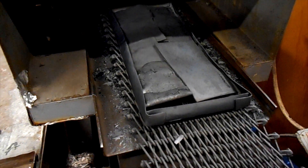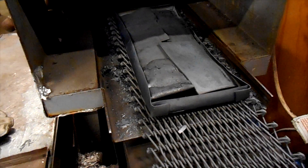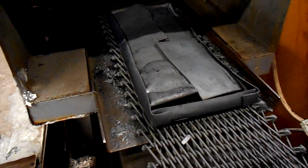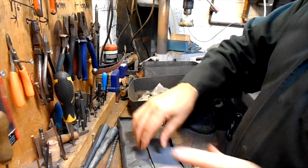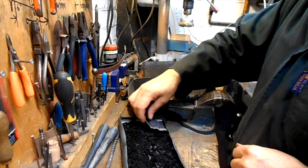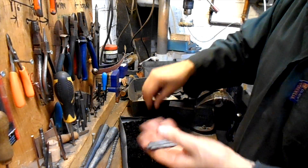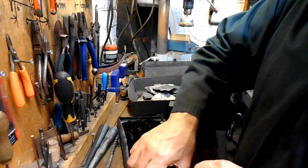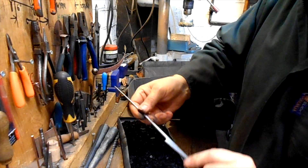There we have the carburised product in the tin, just coming off the furnace. It's taken about an hour and a half to go through the entire process — obviously we're running a continuous belt. We'll take this across for stripping down. This has been through the furnace and been carburised, so we'll strip it back now. There's the charcoal about. They've been carburised — they're not hardened yet, but they're going for further working.